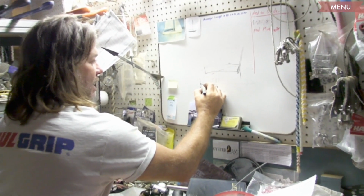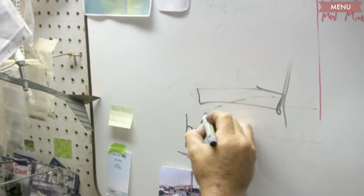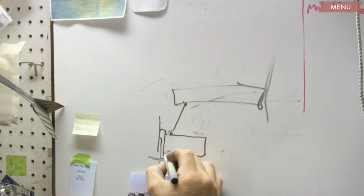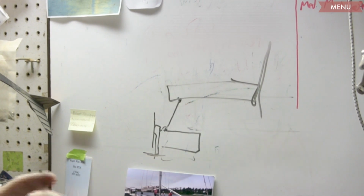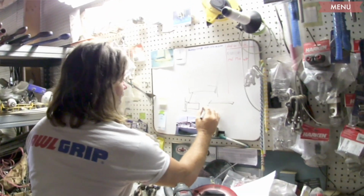There's a beautiful stainless steel swiveling block and a single piece of Dyneema line shackled to one point on the boom. This line disappears into this block, and inside the cockpit floor and in parts of this drop leaf table is a captive line winch. So there's no tail. So looking at the floor, you've got a wheel. This is awesome, right? Yeah.